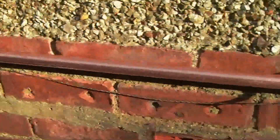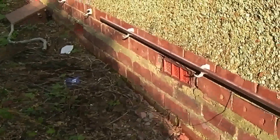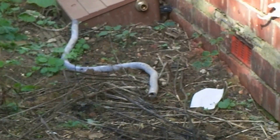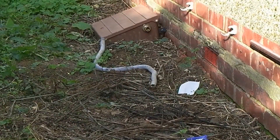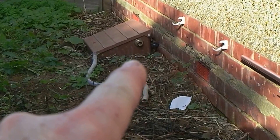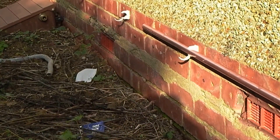I'm putting pipe clips on pretty short distances — you obviously don't want this flexing. I'm going to try and do this with only the one solder join outside. If you look down there, I have saved a piece of the old lead pipe. The idea is, once the pipe holders are on the wall, I'm going to take this pipe off and just bend that piece of lead to the shape I need to go into the metre box — out, a bend, up, and along. Then I'm going to get the pipe benders out and put the same bend into the copper.